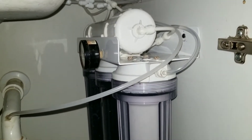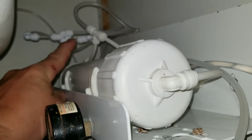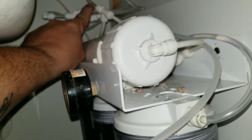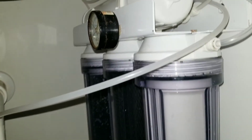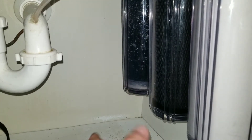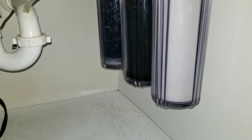To explain how you can have drinkable water: every one of these units should have a switch above the reverse osmosis membrane. My switch was mounted up top right over here — there's a T and an on/off switch, which is now on my switchboard. When this switch is off, it forces the water to go through the deionization process, which is what we use for our reef tanks. But when you switch it on, it makes water and bypasses the deionization process — that function is specifically there to make drinking water.